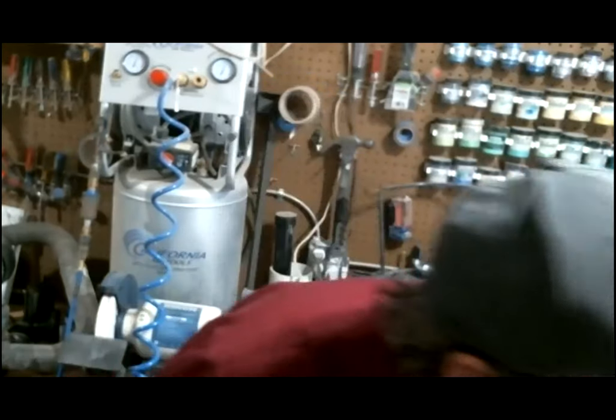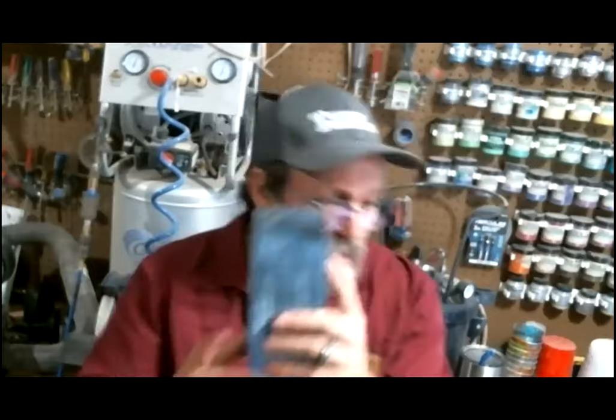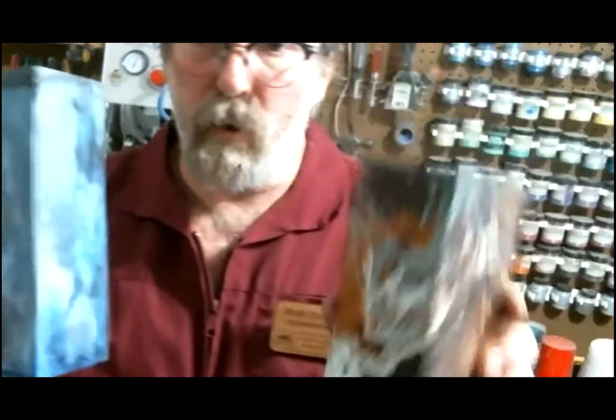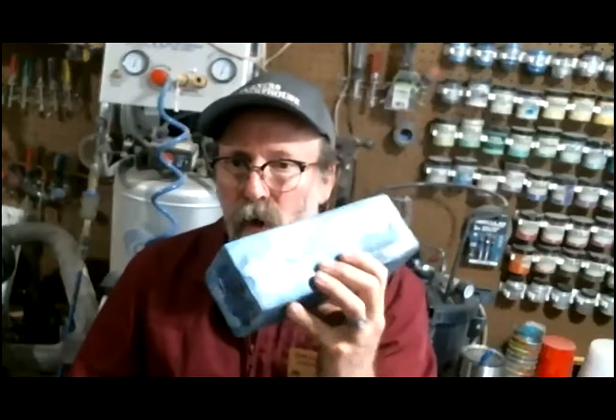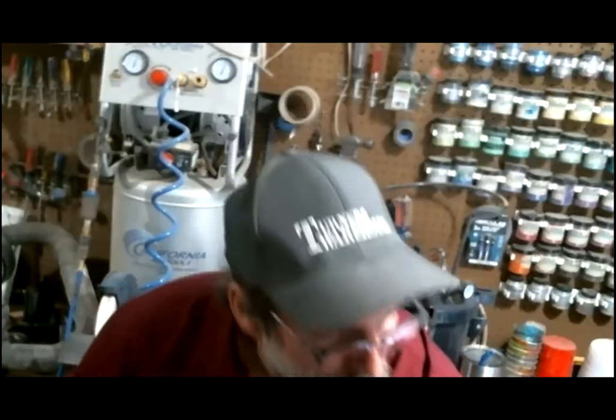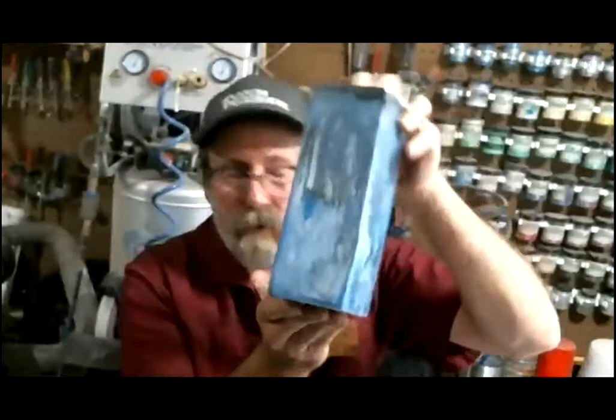When you're casting your pieces and you pull them out, they have a skin on them. So this has a skin on it. It hasn't been trimmed off. I guarantee you that if I was to trim it off, it wouldn't be this color, it would be blues, and there was going to be all kinds of detail in this blank. So you can't go by what's on the outside. You'll never tell what's inside of this until you actually cut into it. So I cast all our blanks in bigger blanks, and then I trim basically a 16th off of every side so that you can actually see what's inside. This could have burl hiding in it, and I would never know it until I trimmed it. That's that skin that gets on it, so keep that in mind.